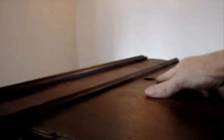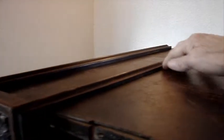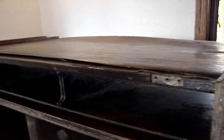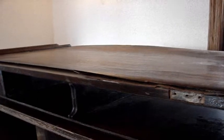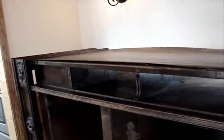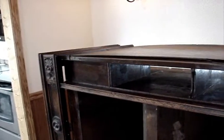I'll get glue worked in as far as I can work it in. The good thing is the veneer is pretty tight down the middle and also pretty tight up here. It isn't down here, however - here it's pretty loose all the way across. So I'm going to have various ways using clamps and weights and stuff to glue this back together. I've got to get this thing all glued before I can strip it down and refinish it. Basically, this is not going to be a restoration at all - this is just going to be to fix it, to make it look presentable, to make it look like a piece of furniture again.